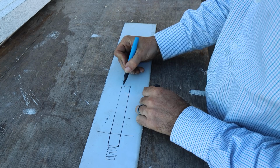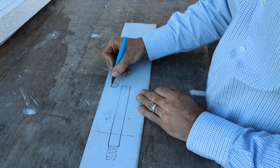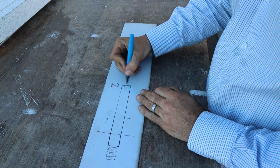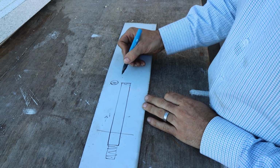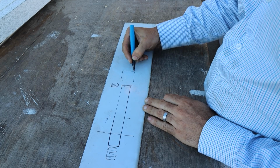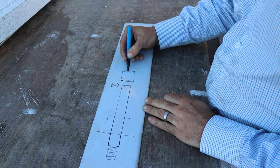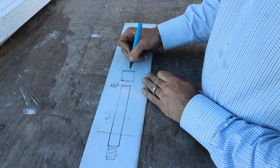We're going to weld a nut onto a piece of strap, so here's the end of the pipe. We're going to weld a strap across it like that, a hole in the middle and a nut, so that piece sits like that, and the pipe actually comes up to the edge here, up to that level there, so that you end up with a completely flat surface on the top. And then I'm going to make a lid that is just a bigger piece of pipe, goes over the top of the whole thing with a stainless top. The top lid part will be solid stainless, so probably 6mm, something like that.